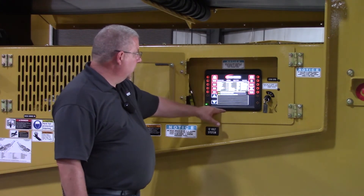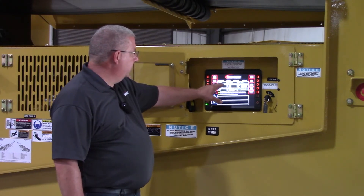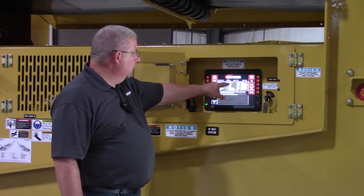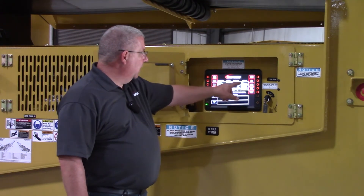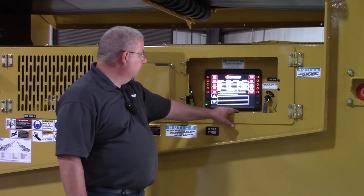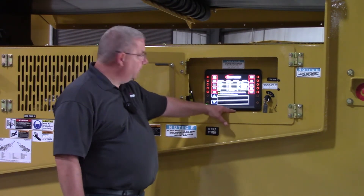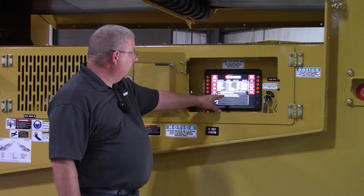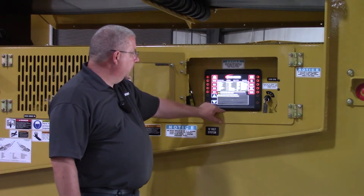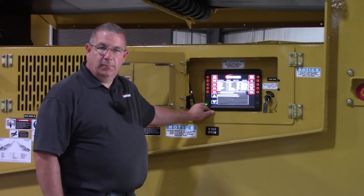In this screen, the first instance is going to be the shredder bearings. There's going to be two of them. You want to grease them every eight hours and it'll also show you the last time it was serviced, and it also tells you how many pumps of grease to put in it. If you just serviced it and you wanted to reset the clock on that, you can hit the shredder bearings once and it'll reset that maintenance interval and then it logs when the last time you greased it is.